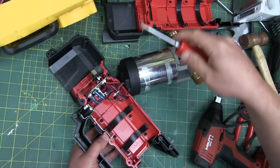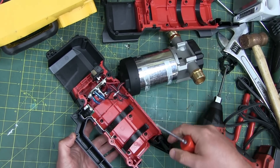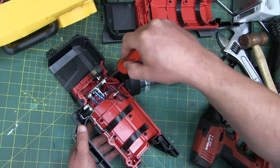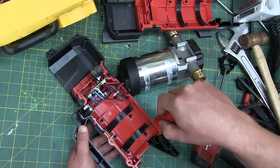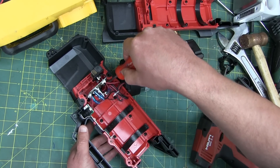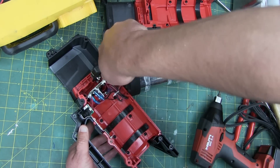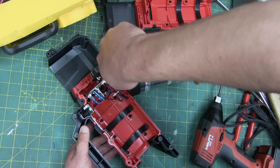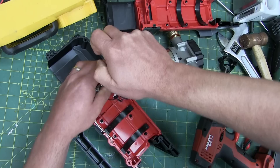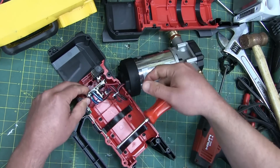Look at the size of that. This is interesting — instead of doing a two-shot mold, they've done two separate parts. I bet that's because they've gone with a cheaper plastic. For some reason they've gone with mechanical fastening. We've got some Buna-N grommets in here for vibration damping. And there's positive affixment for the PCB — well, it's just holding it in the slot, keeping it in that groove.